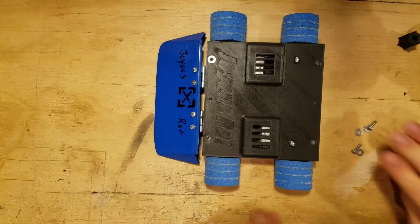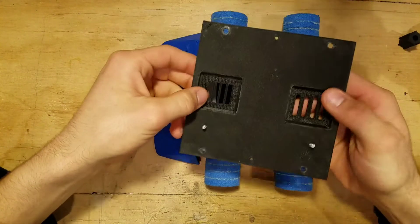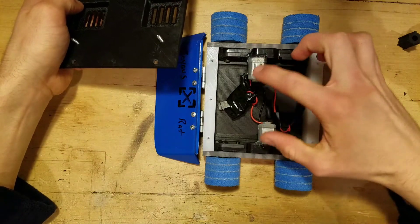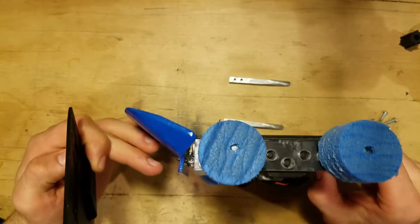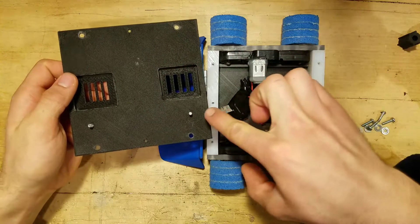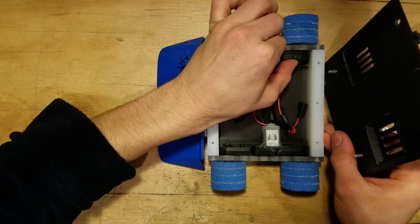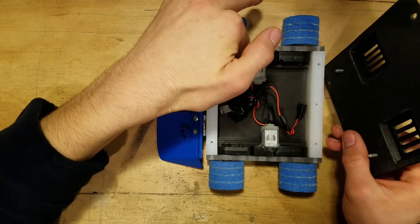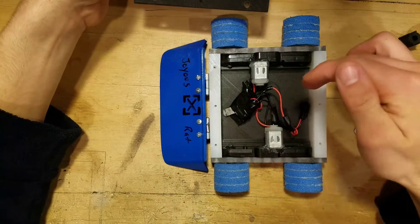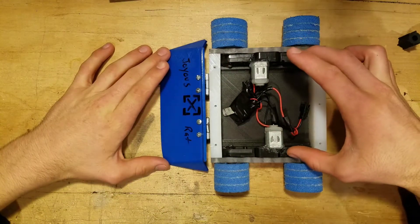Here is the inside of the top — as you can see these little bulges correspond with these gearbox motors that protrude up above the frame. These motors are held in by bolts that come down and hold the gear motor against the side of the frame. The gearboxes aren't actually bolted in — they're just held in by the base plate and top plate.